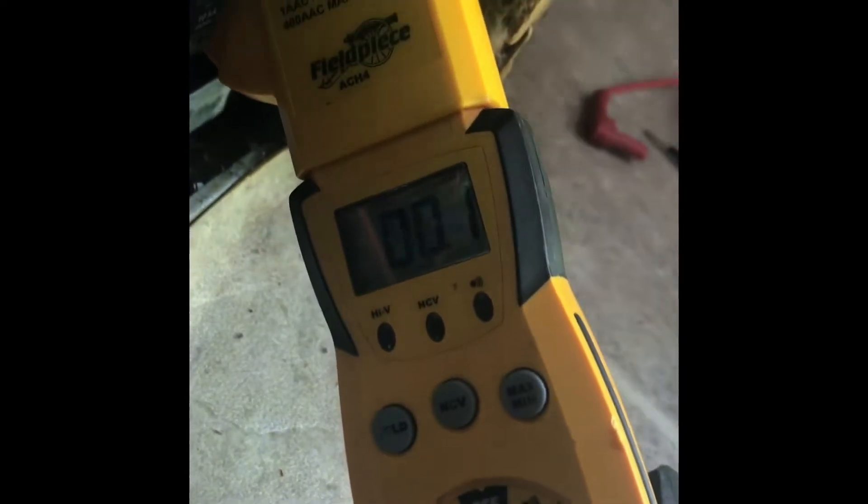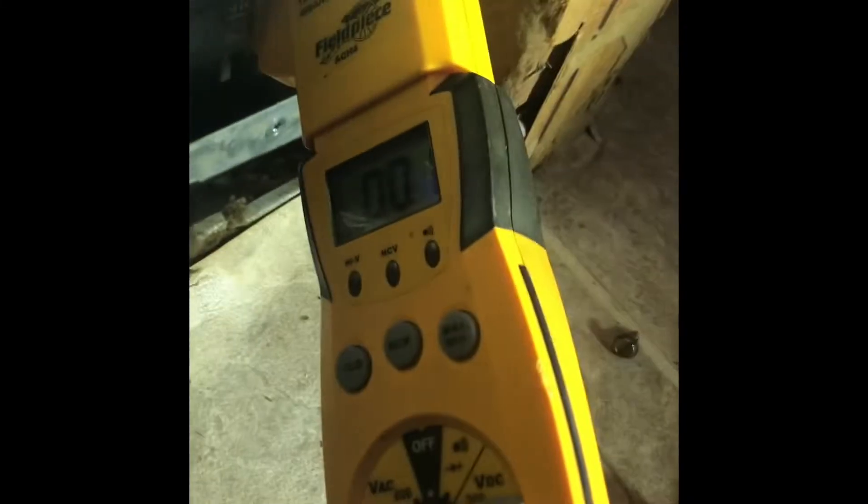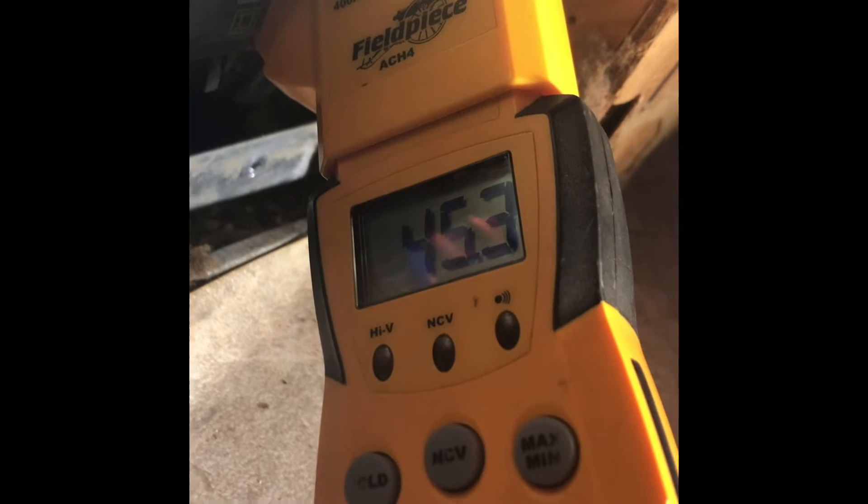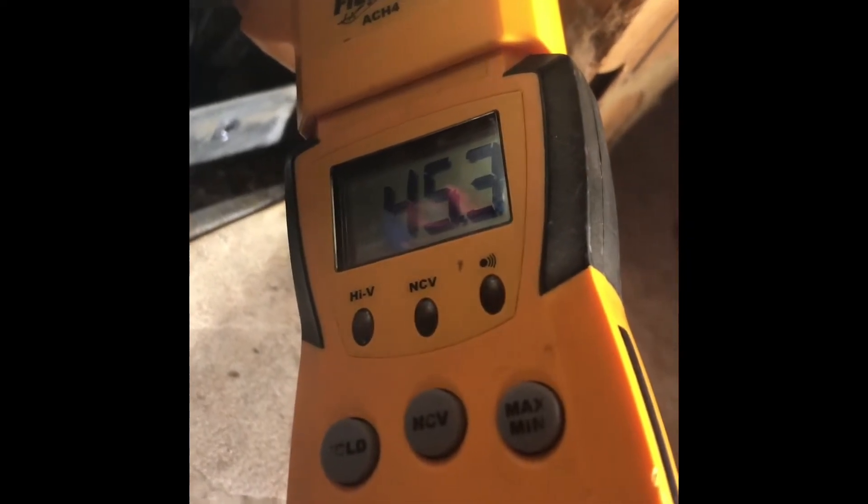Let's see if it works. Let's make sure that when the fan comes on — it's got a 120-second delay, so it might take a minute. There it goes, the fan came on. 47 amps, so the first two elements are on. In a minute we'll hear a click and the amperage will go up as the other elements come on.